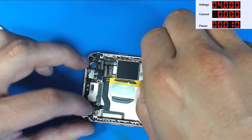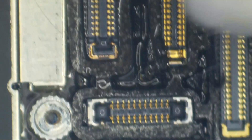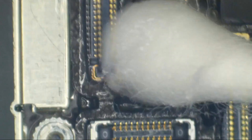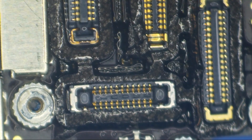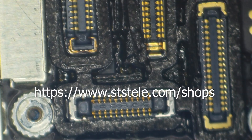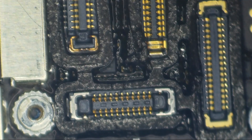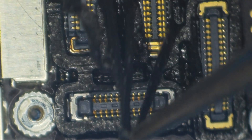It is very likely something going on under the CPU shield. Let's take the board out and add some alcohol to these sticker pad things here because they're going to get severely destroyed whenever we heat this up to remove the shield. Now this is going to be what I would consider a backlight system repair and not just a backlight repair. We've recently published a repair list for other repair shops — many of you have been asking, and we've just been really swamped, but now turnaround time is down.